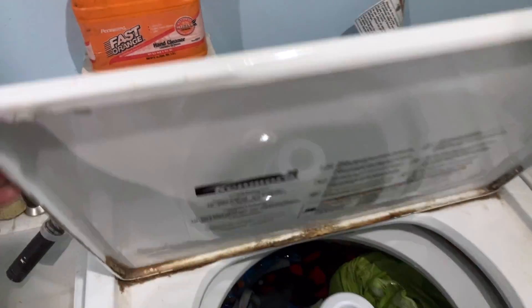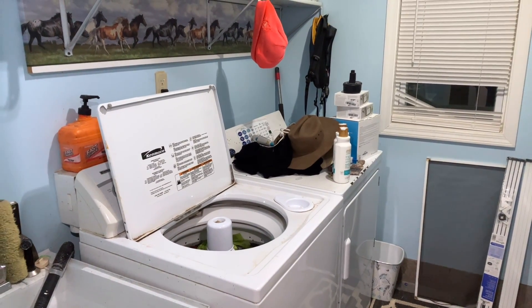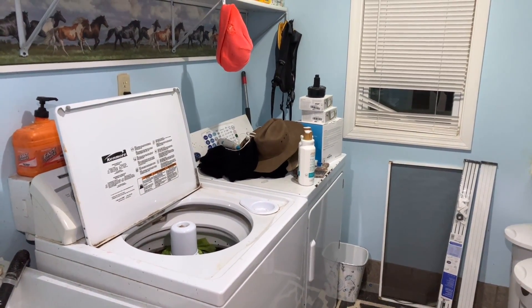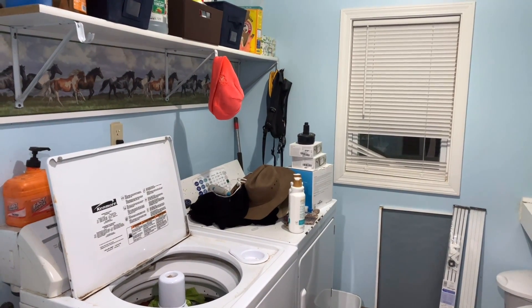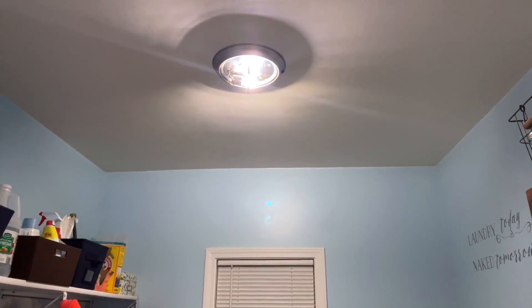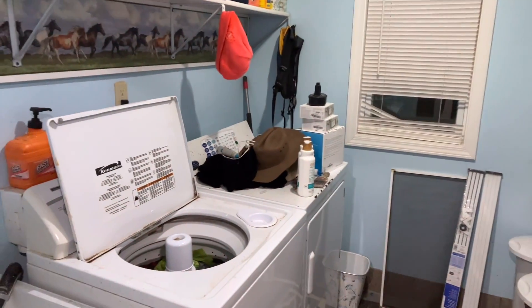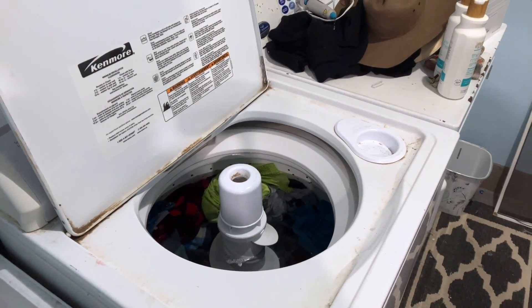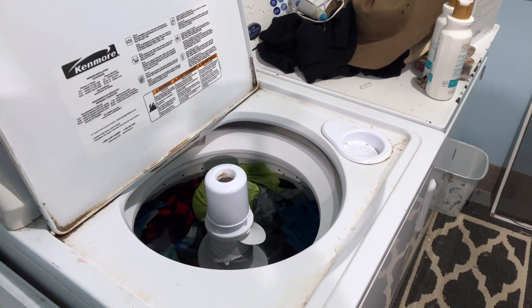It's got a full load of colors in right now. It used to have the refrigerator light pulse in tune with the washing machine, but I switched the phase that this laundry room is on. So the fridge no longer does it, but the laundry room light and one of the bathroom lights still tend to do it. Supposedly, if you put a better quality LED bulb in you don't get the flickering. This is a janky chandelier LED bulb right now. The wash is filled up — we're going to turn it on, see the pulsing, then swap out the bulb and see if that makes any difference.